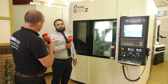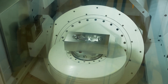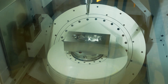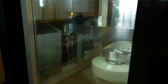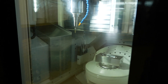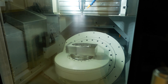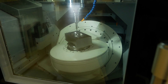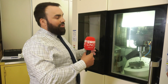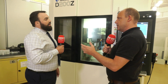There are two key things: the accuracy this machine can achieve, and also the surface finish. The Makino has a GI smoothing function within the machine which actually smooths out the toolpath you've created. And with this table design, the low vibration the machine produces allows it to produce mirror finishes, removing the need for manual work on the component after it comes off the machine — machining to extremely tight tolerances while also removing the need for additional operations.